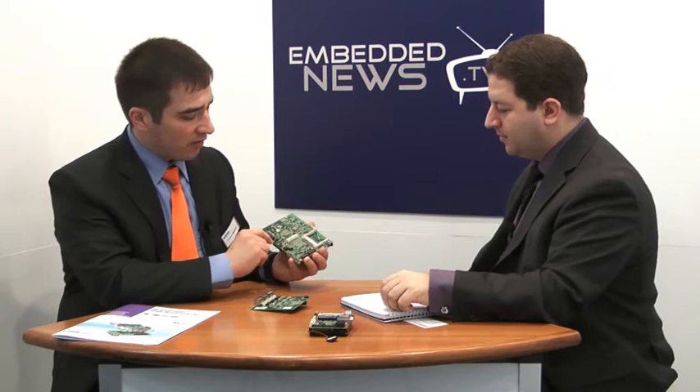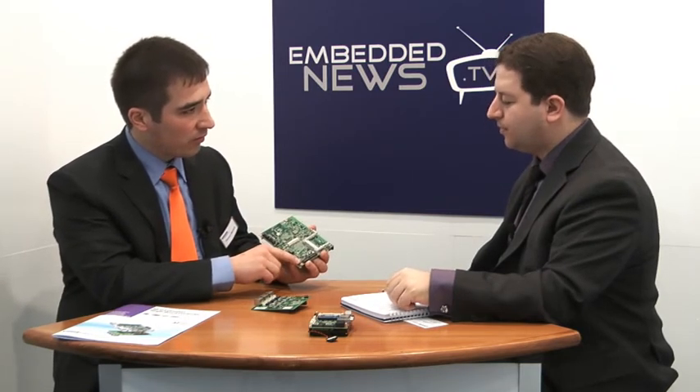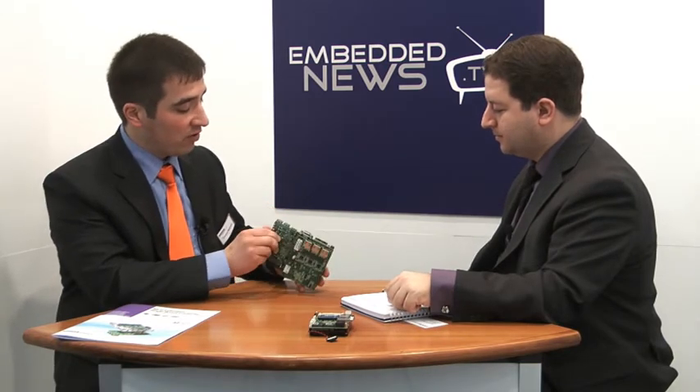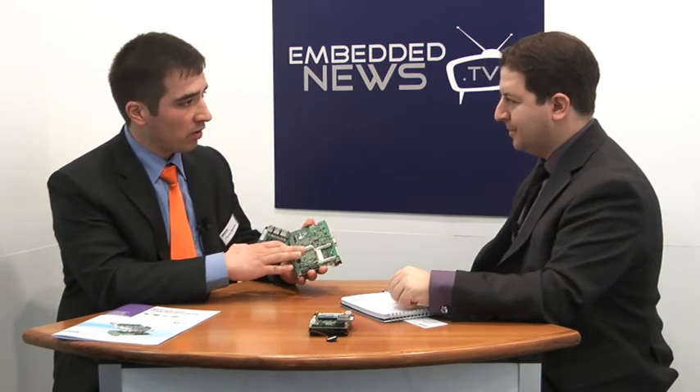The major key benefit is about the MIO connector. With the MIO connector, you're just getting a board and you have some IOs, but you can also buy additional output modules. They're called MIO extension boards — modules you just plug to the board and you have, without any cabling, four more LAN ports. You could have serial ports and so on. And the best thing is, this MIO connector is an open standard, so everyone can design his own board.